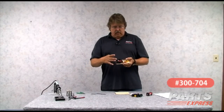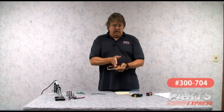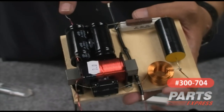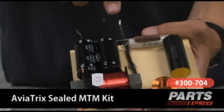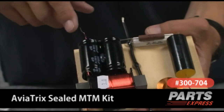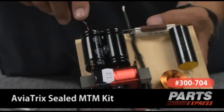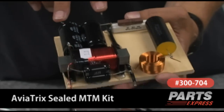This side is the low pass for the woofers — of course, big parts for the big speaker, very simple. The smaller parts on this side are the high pass for the tweeter. And these are the inputs that come from your amplifier. This is the ground — I made the wire black — and this is the input side, or the hot side, the positive side coming from the amplifier. So these are your inputs.